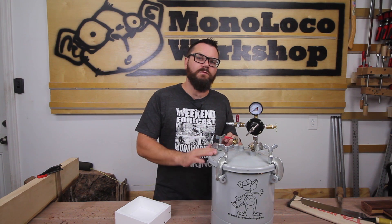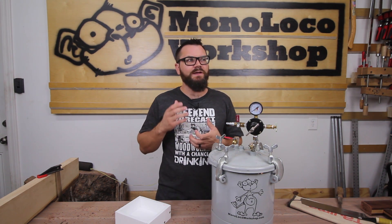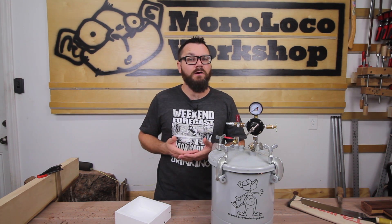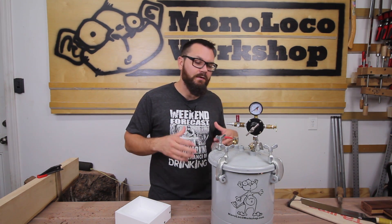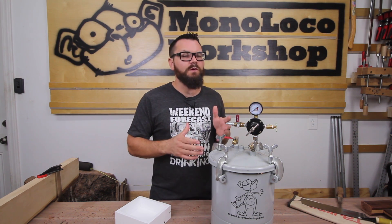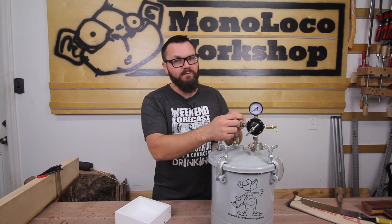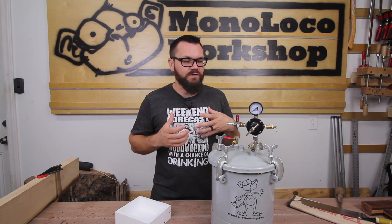There are a few ways to go about converting the paint pot to a pressure pot for casting, and I'm not going to get into the nitty gritty details. There are quite a few ways to do that, and I will provide references to some very good articles I've found on my website. But the gist of it is, depending on the setup you choose, you're going to need to get a handful of adapters. Really you need to get your compressor hooked up, a ball valve, and at least a cap. That is the minimum that you're going to need.